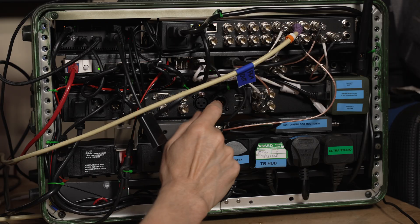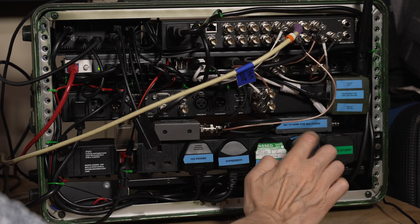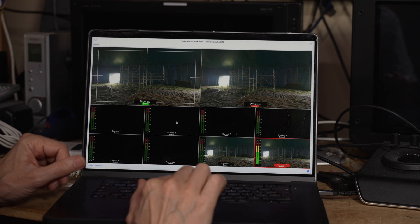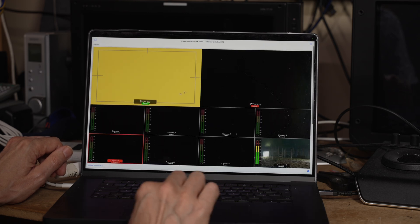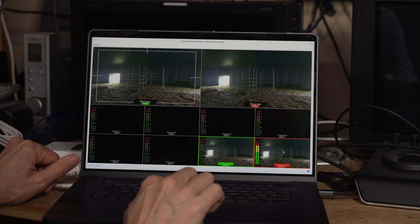If you're using a computer with the Mix Effect app, one of the things I've included in this rack is an SDI to HDMI mini converter, and then that HDMI goes into a low-cost USB capture card, which is connected into the Thunderbolt hub. That gives me a UVC input — taking the multi-view into a computer, in my case a MacBook Pro — and it allows me to use the Mix Effect USB view function, which overlays the controls over the multi-view. So you can click on the camera source you want, see the live view, all on one screen. If you have a newer iPad with USB-C rather than a lightning port, it'll also work on a tablet.